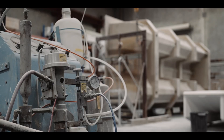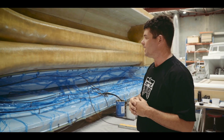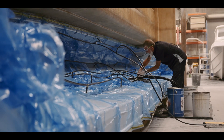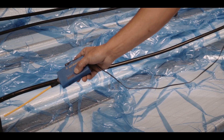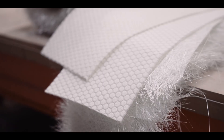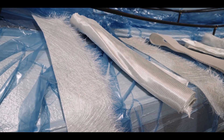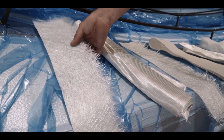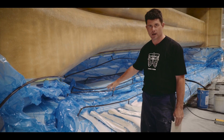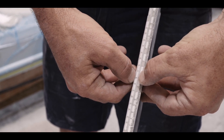What we have here is our 10 metre mould sitting up in our rotating jig. The boys have spent the last three days stacking the laminate into the mould. It's the same laminate we'd use for a survey boat — it's all bagged down now, under full vacuum, leak checked, and ready for infusion. Under the bag we've got a number of different layers that go into building the laminate structure.